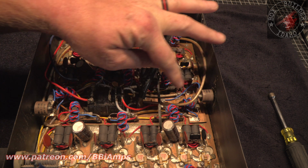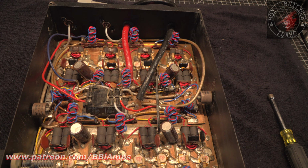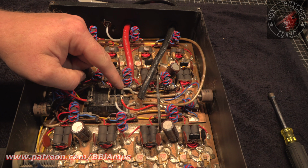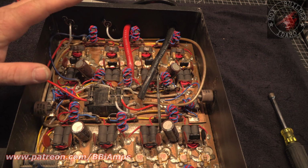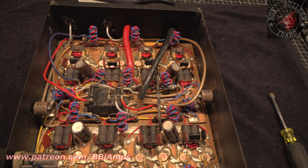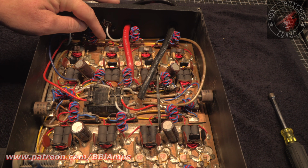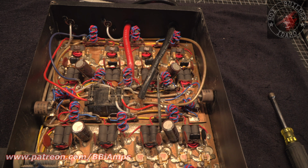So because of this extra 2.5 foot of coax, and on some of the bigger stuff like the 32s and a few 64s that were built, you might have 3 or 4 foot long in there. Well, as far as the linear is concerned, it's done doing its thing right here. Done. And so the Carl, X-Force, Dave Made style, my way, other people's way of building, we put the relay right next to the coax connector, and then we tune to the relay connection, and this is where we start measuring our coax length. So what you're asking me for is almost physically impossible, is what I'm getting at.